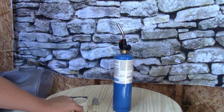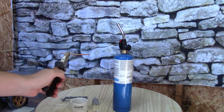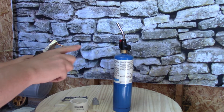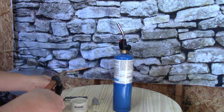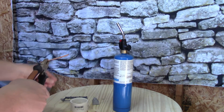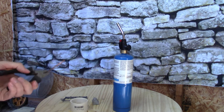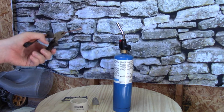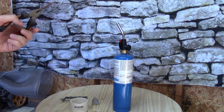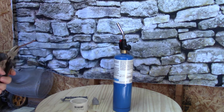The way this test works is: we turn on the blowtorch, heat our copper wire up until it is red hot and glowing, forming a little oxidation layer. We touch this onto our sample to get some residue on it, then put it back into the flame. If the flame stays red, that's a reaction with carbon and we have a safe material. If the flame turns green, that indicates the presence of a halide — chlorine — and that material should not go into your laser cutter.